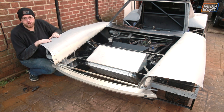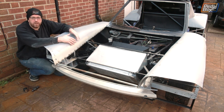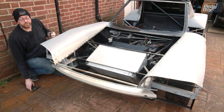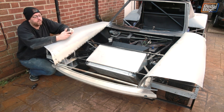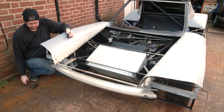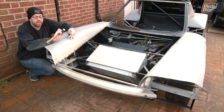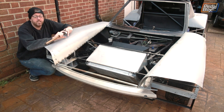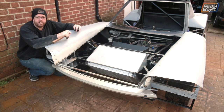It takes a lot of time shrinking and stretching the metal to get it into the right place and it's not something that's easy to describe — it's something you need to feel your way through to learn. The basics I found are: on a curved panel, you want a curved dolly like this one, which is curved on two different sides. This one went in line with the inside edge across here. For the hammer, you want a flat head if you're on a flat panel so the edges don't hit the sides, and if you're on a curved panel you want a domed head, which feels very counterintuitive but makes sense because then you don't get edges knocked into it.